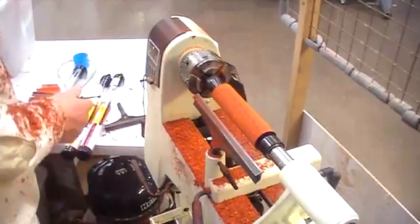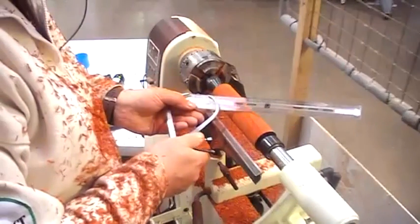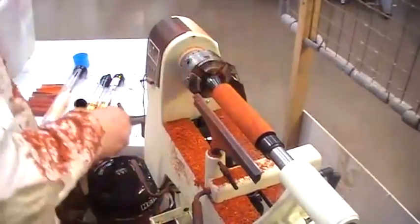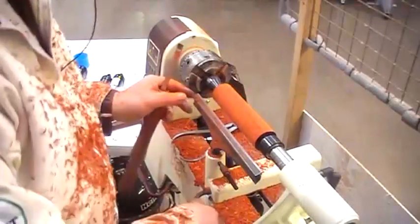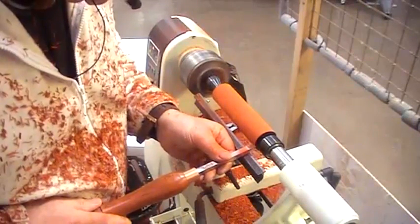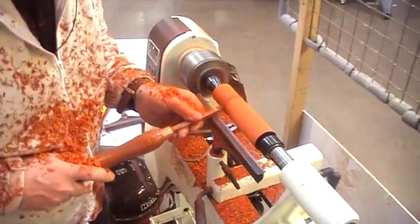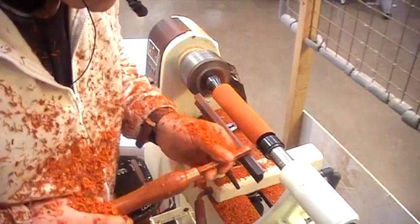I'll set up the calipers to around about 42mm and open that up. Try that in there — it's almost there, just tight. So I'll just need to take a little bit more off. I can move the tool in parallel and keep it parallel with the bed as a guide, pull it under there and go across. I'm feeling the same all the way off there.